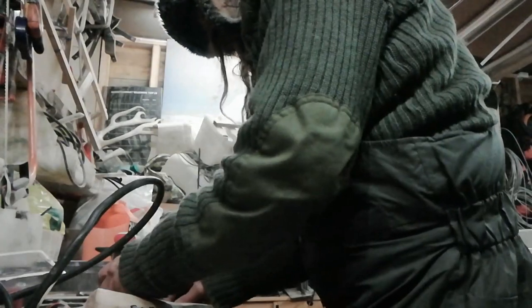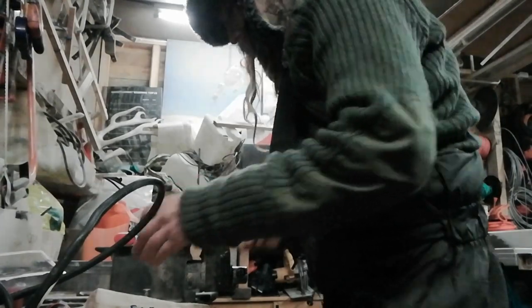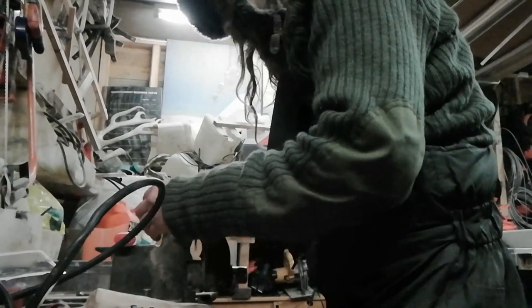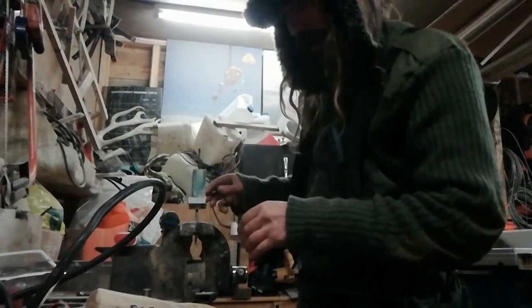Next one. You can see that in the holes. I mean, it's supposed to be 5 minutes and this goes off. I generally, for knife making, especially with the giddywinkles, like to use the slow epoxy because it gives you a little bit more time to correct things.